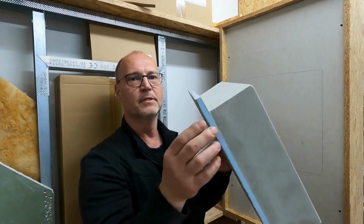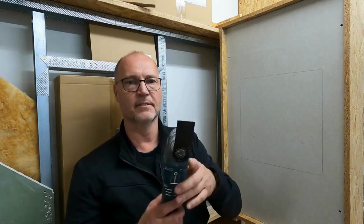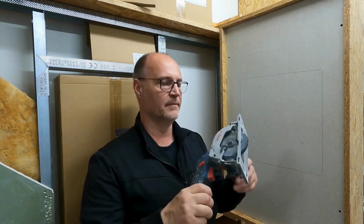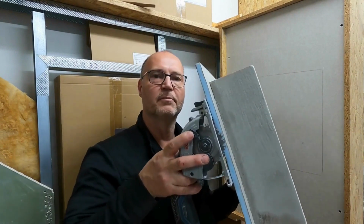Now I need to cut out the top layer for this flange. How do I do that best? Everyone has their own methods. I quite like using this small oscillating multi-tool or this small handheld circular saw. I don't need them too often, but especially for drywall work where it's just about 12.5mm gypsum or even 25mm solid construction panels, it's absolutely sufficient. I've already preset it to the measure of approximately 12.5 mm, so that I carefully and precisely cut as little as possible into the lower layer, ensuring that only the necessary amount is removed.